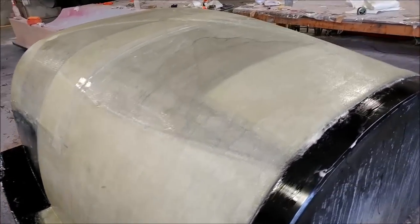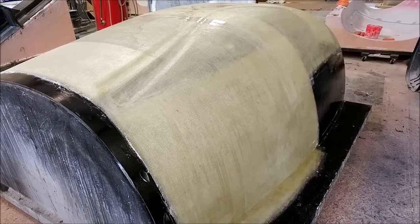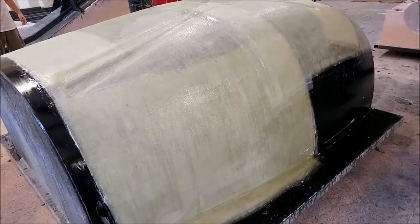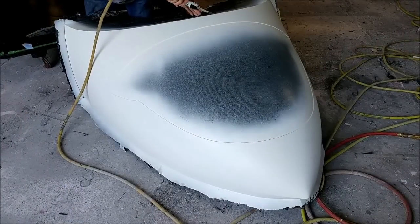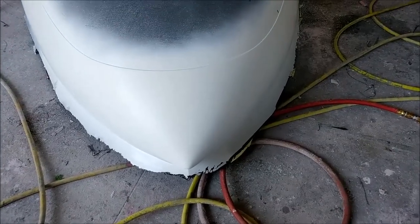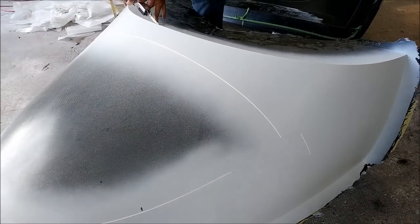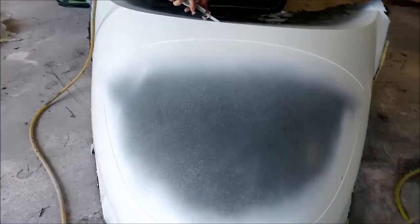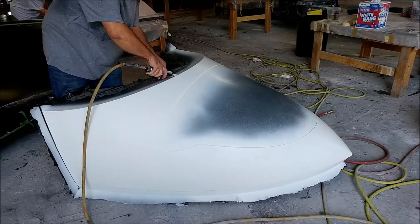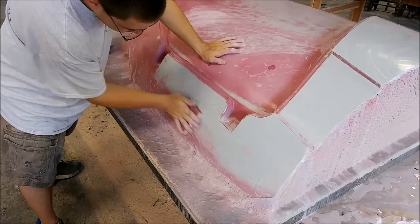Here's our routing mask on the roof finished up. It's not super pretty but it'll do the job — you'll see later with it on the machine, cutting out the edges we'll use to follow with the router. Now it's Friday morning and here is the nose popped out from the mold, looking super nice. It has the epoxy topcoat on there so it looks almost like a finished part, but on the aircraft it will still get sanded and proper painting — it's just like a primed surface basically. Jeff is there with the reciprocating saw just trimming off the edges of the flanges.